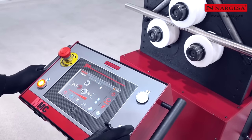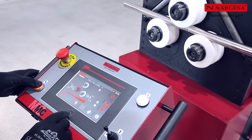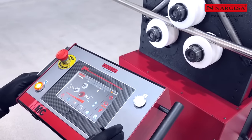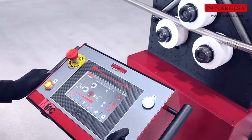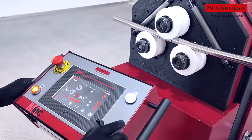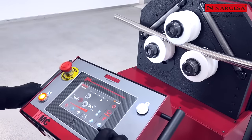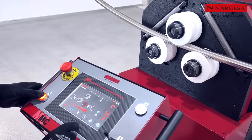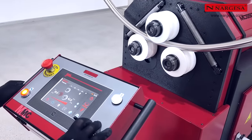Place the pipe in the first mark, slightly raise the X-axis, and activate the joystick to create the bend to the final mark on the opposite side. Now raise the Y-axis roller and use the joystick to continue bending the piece, reaching the second mark on the other end. Repeat the described procedure again, yet finalizing each successive bend, end to end, one mark before, to shape the piece without any marks appearing in the intersection between points.